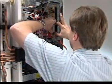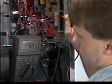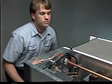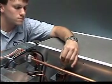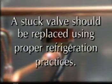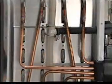To check for voltage, pull the 10-pin connector out about 3/8 of an inch and check from the pin on the pink wire, which is the hot gas valve, to a neutral white wire. If you get proper voltage, the control board is working. If not, the problem is the control board. If you do get voltage, check the coil to be sure it is energized. To do this, lay a metal paper clip on the coil. If you can feel a magnetic pull, the coil is energized. If the coil is in fact energized, it is possible that the hot gas valve is stuck. A stuck valve should be replaced using proper refrigeration practices.